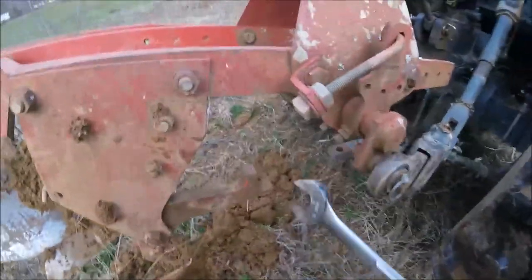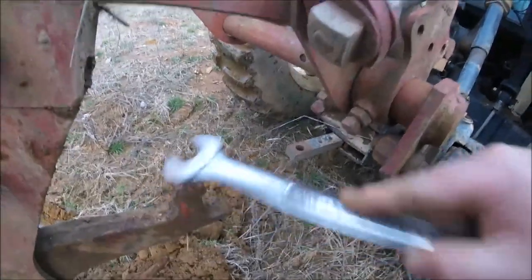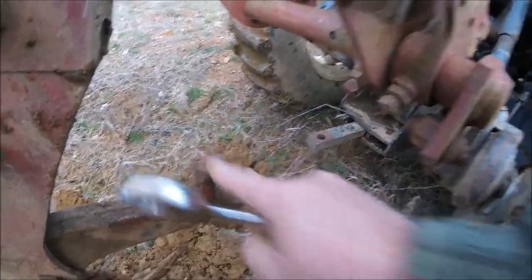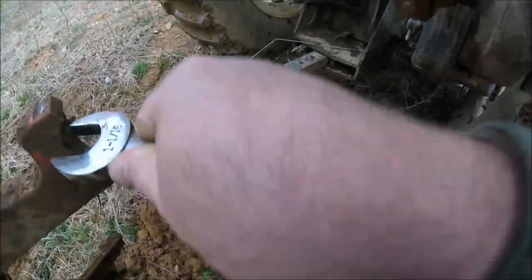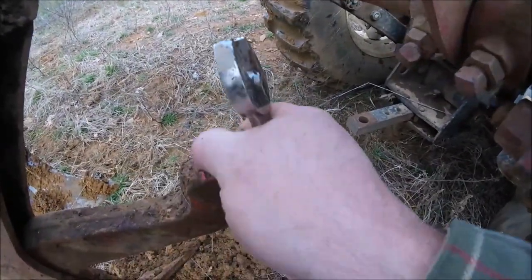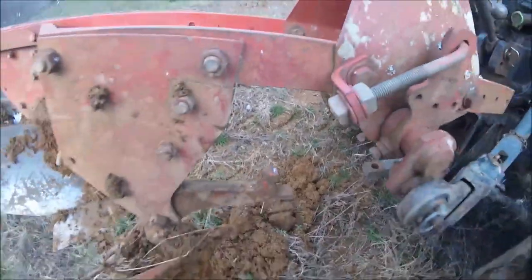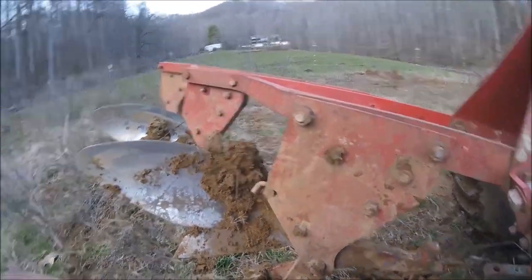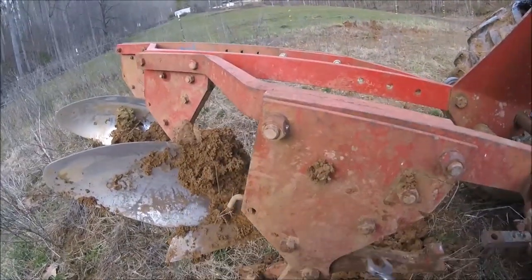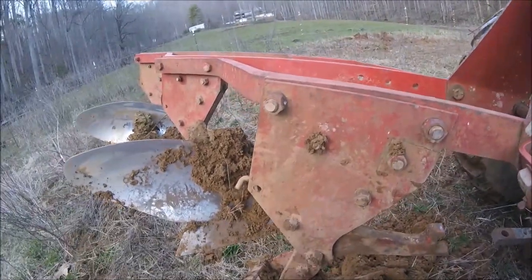What we got is a little mud on them because it's muddy, but you can manually trip these things. You can see right here — these aren't worn bad at all; there's pretty much paint on everything everywhere that it goes. You can see that tripper's not worn bad at all, still got the casting ridge in it. Right here is where it locks on this machined surface. Feel for good sharp edges — that plow's still in excellent shape and I'm going to keep it tight so that it doesn't trip excessively and wear out. But that's how you manually trip them. Sometimes they'll be stuck — you'll pull that tripper and that plow still won't come loose; the shank can seize right in here, seized to your side plates. That's how you manually trip a forward spring trip plow.